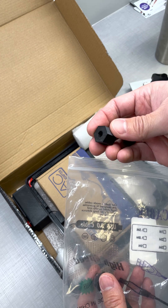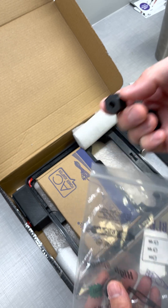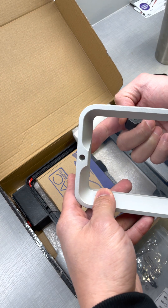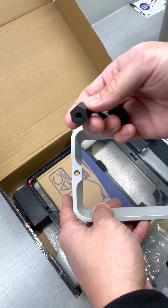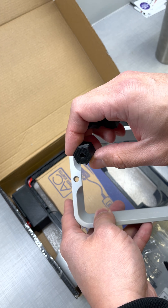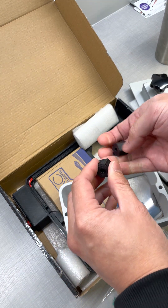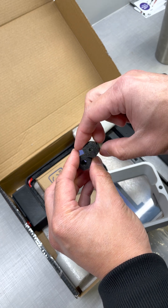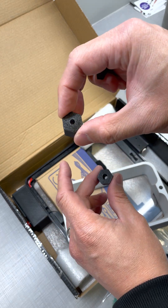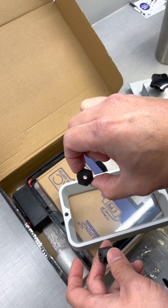These are the speed nuts — a modified nut that goes over your post to hold your vat in. Normally you have a screw that retains your vat and comes straight through. If you look on the inside, you'll see that one side is threaded and the other side is not. The reason for this — and you can see them side by side since I have two — is that the threaded side is smaller. Basically it slides over your post quickly and only has to thread on the last three or four turns, making it much faster.